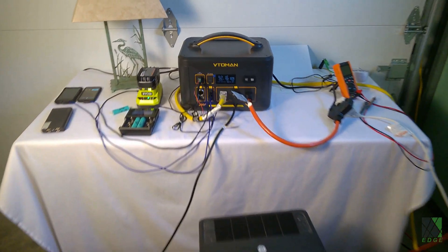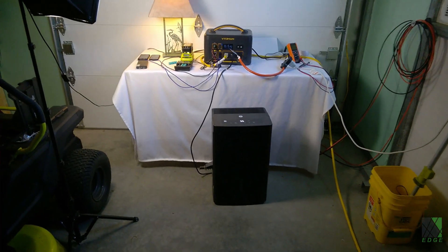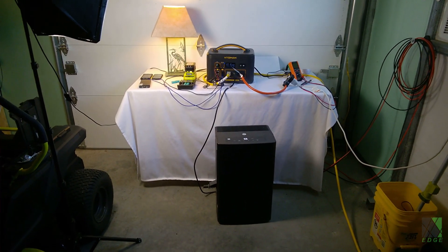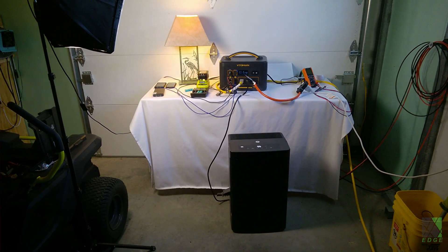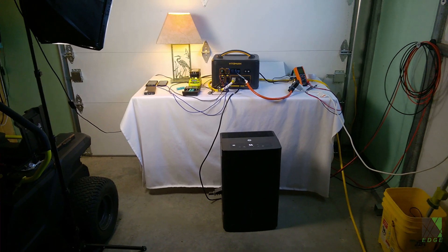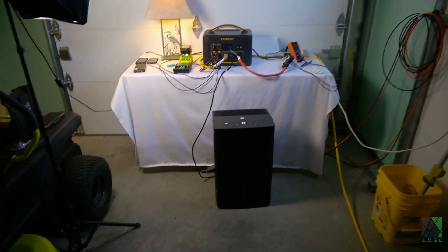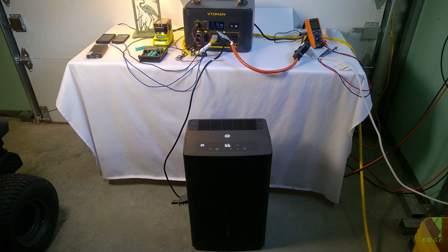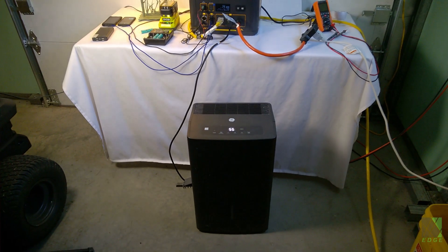Let's check the display. We had one casualty so far — the CFL bulb in that lamp just blew up when that thing started. So that's not good. That's the result of pushing a high-frequency inverter really hard. When that thing kicked on, perhaps it caused a voltage spike and the CFL bulb burned out. It is able to run the air conditioner and it's able to run the dehumidifier. This is an extreme test and I wouldn't really recommend pushing it that hard, but now we know what happens. Probably shouldn't try to run two inductive loads on this unit — not a good idea.